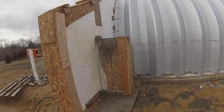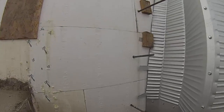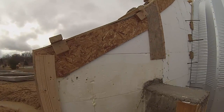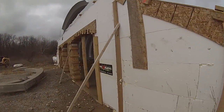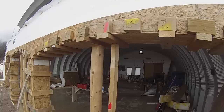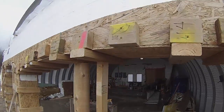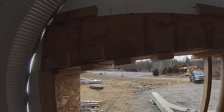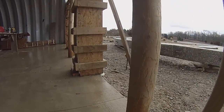Going around to the back side, you can see that we left the top of this T-section open — it'll all be buried, so it doesn't matter. I just wanted a bit of a toe to keep the wall stable. Here you can see some scrap blocks screwed through the tabs and into the Fox Blocks. This rebar hints at a later step where we'll cover the Quonset hut with rebar and then concrete and then earth. The vast majority of this wood is recycled — these were all part of the ribbed forms. No leaks or bulges. You can see that the pressure caused the bottom of this 2x4 to split; I'm glad we added these posts.